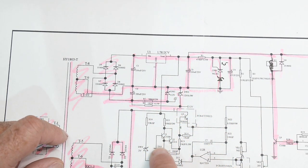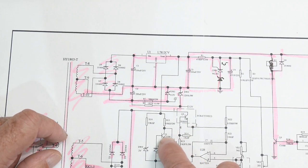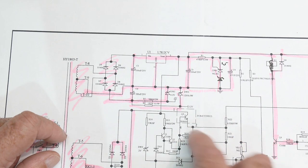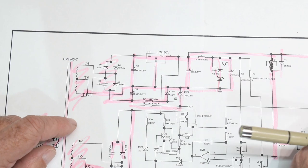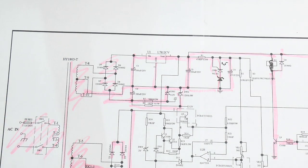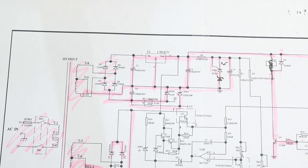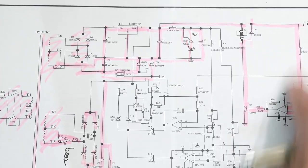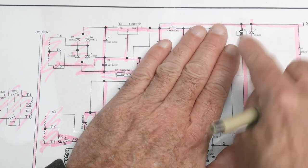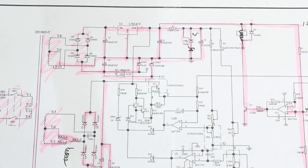There's a funny thing down here that we don't quite understand — it doesn't seem right. But don't panic. If you don't understand something, just make a note: note 1 — '12 volts?' We don't give up. We think we know what this circuit is trying to do — it would make sense if this were hooked up to something other than a solid 12 volts. We understand its functionality, so let's just mark it with a question and move on to start looking at the rest of it.